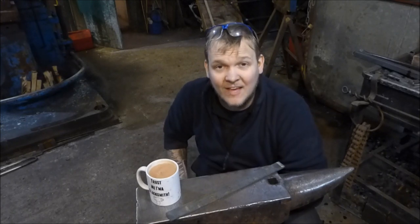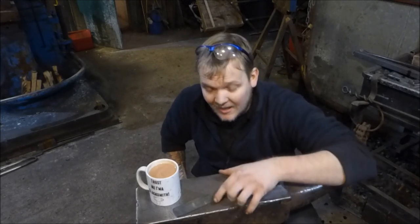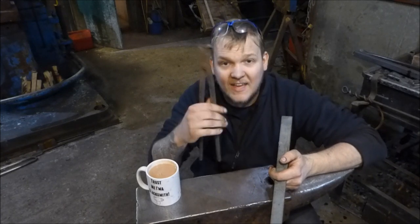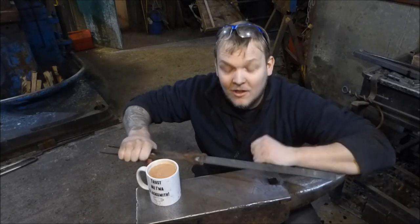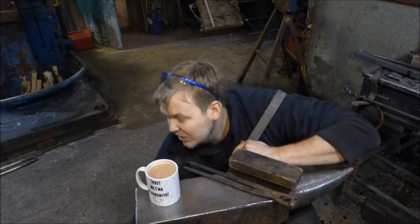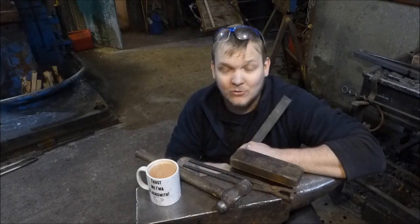In each episode I'm going to go over the materials and the tools you're going to need. The first thing you're going to want to do is get yourself some flat bar — I'm going to put the American measurements below. You need a piece of 30 by 6mm flat bar. This is mild steel. If you want to make this a real sharp knife, you're going to have to get yourself some O1 or W1 tool steel. I also have a set of bladesmith tongs — there is a video for this, I'll leave a link at the end and in the description. These hold this stock perfectly. You're also going to need a wire brush, a block brush, and a hammer of your choosing. You're going to need an anvil, and also a heat source, whether that's gas or coal or whatever.